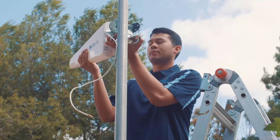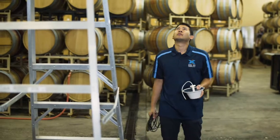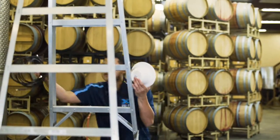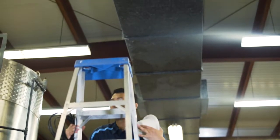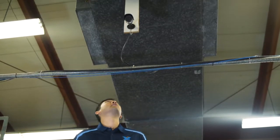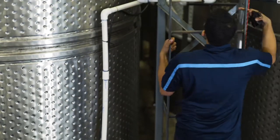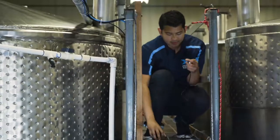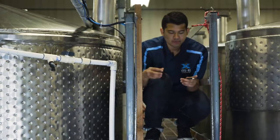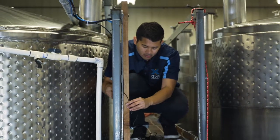Don't mount the antenna or bracket yet — continue the planning process. Next, find a location for the server antenna in an area of the building where improved coverage is needed. Keep in mind that maximizing the distance between the donor antenna and the server antenna will provide maximum gain and a larger coverage area from the server antenna. Now we need to find a spot to install the CellFi Go unit. When choosing a location, make sure you find a spot with good airflow, close enough to a power outlet, and close to the donor antenna. This will help ensure maximum input signal from the donor antenna.